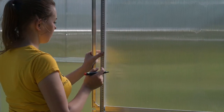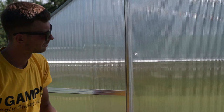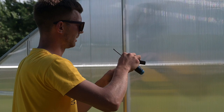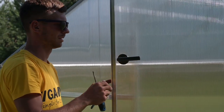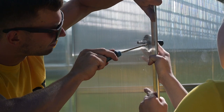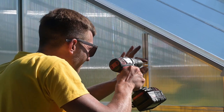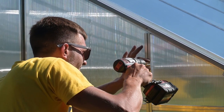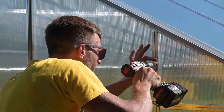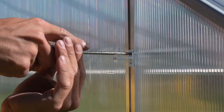After installing the door, measure the spot you want to install the door handles and hooks. Mark the door and drill three holes in them, using the handle as a measurement. Install the handle by leaving its wider end on the outside. Drill holes on the strut you want to install the hooks on, attach the parts, and connect the parts of the hook onto the handle.